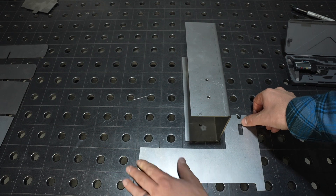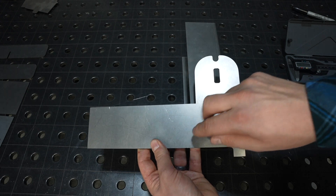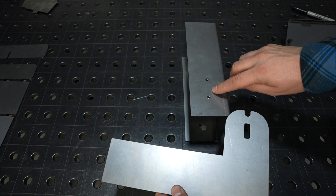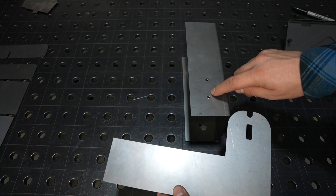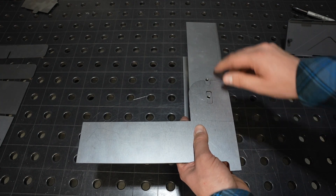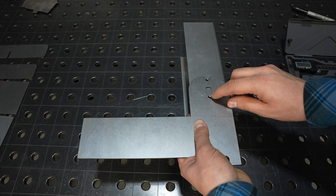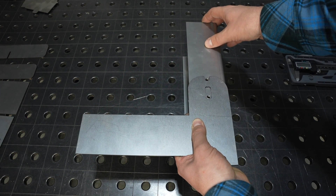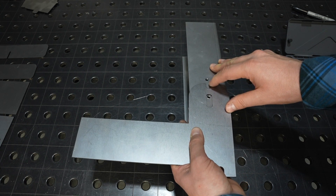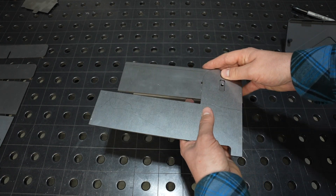Let me show you how this folding mechanism is going to work to fit everything down in the box. This is the side of the main inlet tube where combustion will happen, and this is part of the chimney. There are two threaded holes and I'm going to put a socket head cap screw in each to act as a pin. That will sit right in these slots — when in use it'll sit down in the groove and keep everything locked in vertically, and when you want to fold it up you just slide it up and rotate it around.